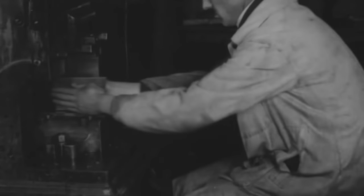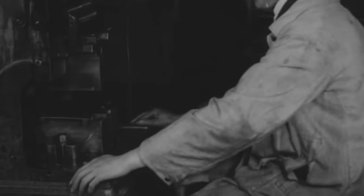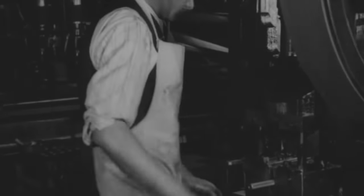Mag technology is actually pretty wild. People take it for granted because they seem like the disposable part of the gun. But I try to explain to people all the time, detachable box magazines were a concept in like the 1850s. We knew about it. It was just, look at what it takes to get one just right. And then you go out in the field and it gets dented, and what are you going to do? So putting it in the gun and making it out of much harder receiver steel and just dealing with the reloading issue was a lot easier, a lot more sensible for a long time anyway.